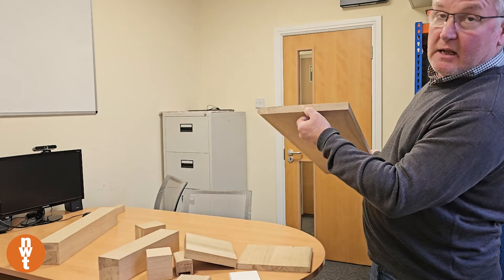We then move on to our stair string — laminated stair string. Again, fully oak stave core, full length oak stave core, so you don't have any issues of going into a softwood or whatever core with a full veneer. The strings are 32mm by 240mm. We carry them currently in stock at 4.2 and 4.5 metres, but please always enquire on what lengths we have available for those parts.